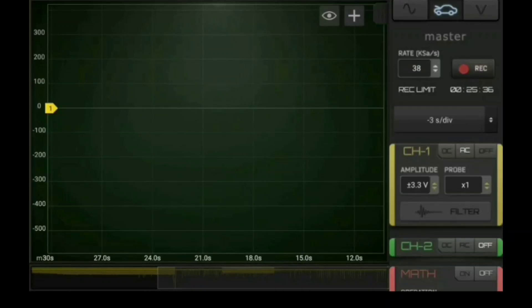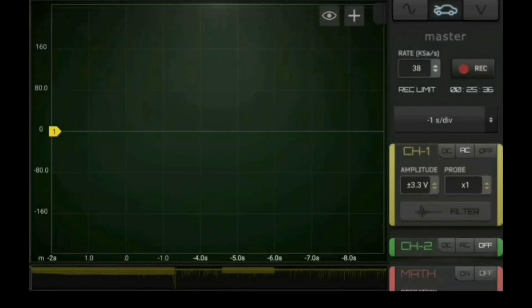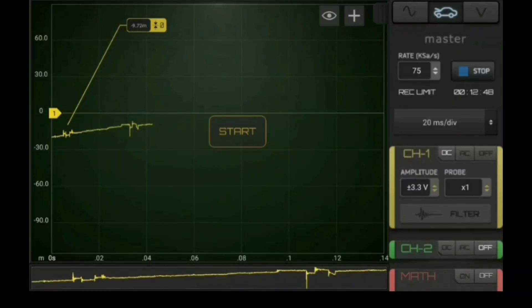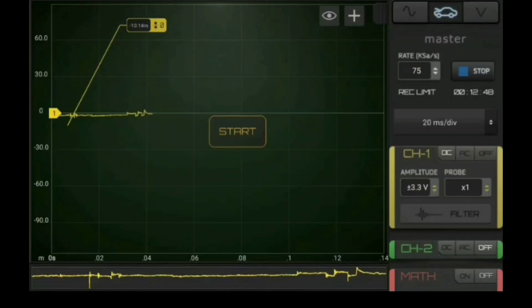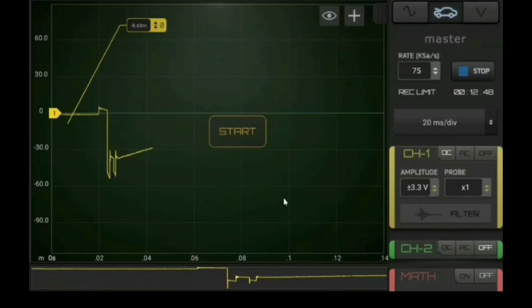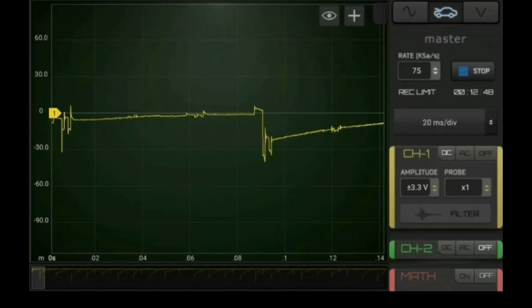The data is still down here in the buffer but all the data is gone — there's nothing I could zoom in to look for. I already got a comment back from Martin Lorne on the Telegram group and he suggested using an AT10 attenuator. He built EMI protection into it for the interference, because the cable and the way the wires flip around causes interference. I'm running it now with the times-10 attenuator that I purchased when I got the scope, and luckily I had one here. It seems to be working flawlessly.